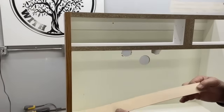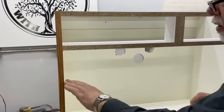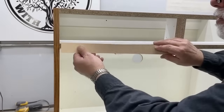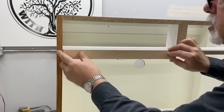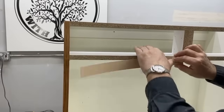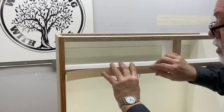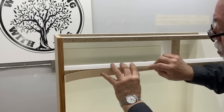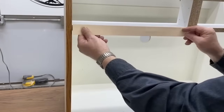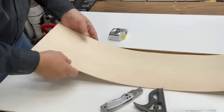I've cut this piece of veneer — it's inch and a half. This is a three-quarter inch face, and we want to lip our veneer back on our sides and bottoms at three-quarters of an inch to give it the appearance of being a three-quarter inch thick face to our cabinet. The tools you need to cut veneer are very simple: obviously your veneer, a good sharp utility knife, a small square, a good long straight edge, and a tape measure.